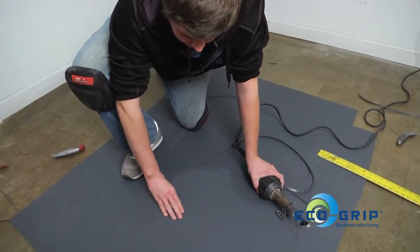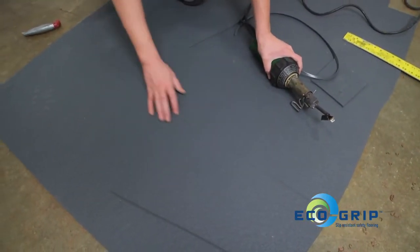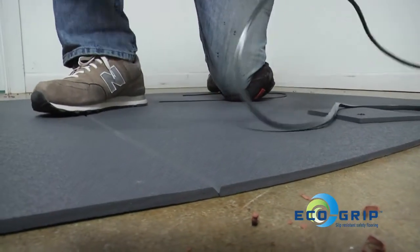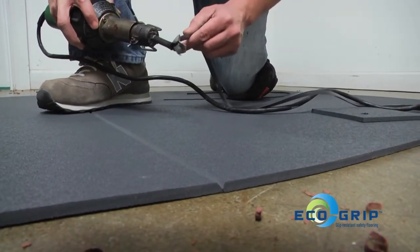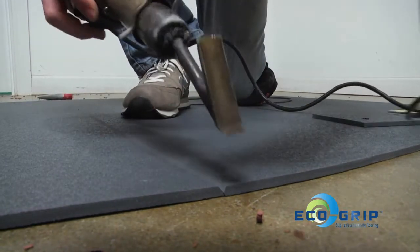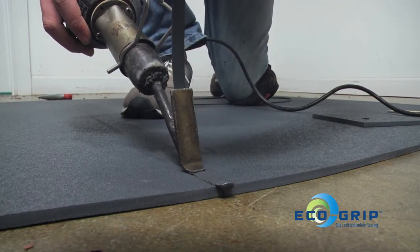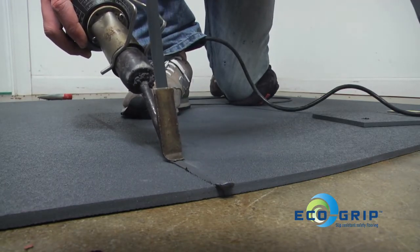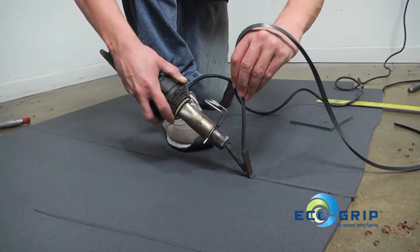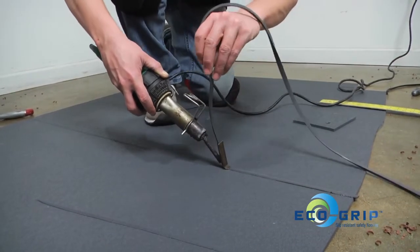Your first step welding is to make sure the cut is good and that your floor is level on both sides and all the way down to the floor. Any fluctuation where one side is an 1/8 inch or a 1/4 inch higher than the other is going to make the weld look suspicious. When you start a weld, warm up the tip a little bit first. Take your time and be very consistent — keep your welding tip very level so you don't make marks on either side of the sheet. If you slow down too much you'll burn the sheet; if you speed up too much you'll leave cracks or the weld won't go all the way through.